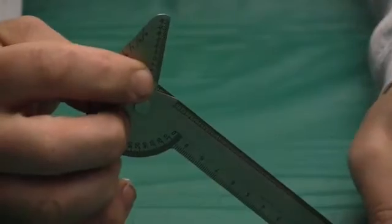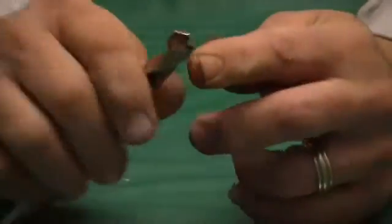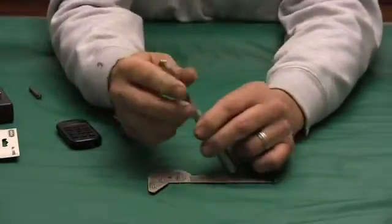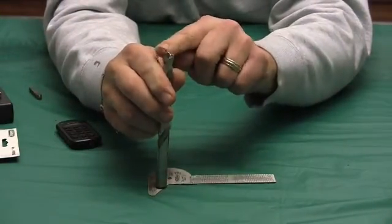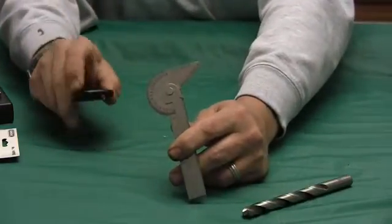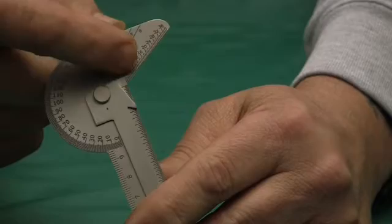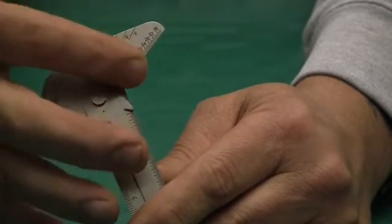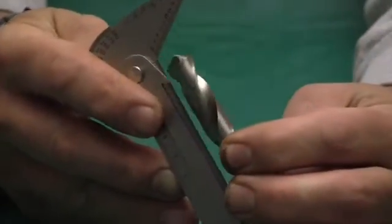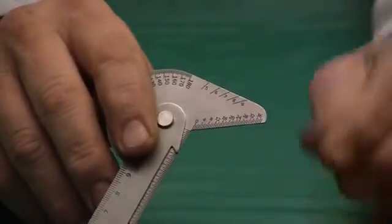And then what you use this graduation here for is to make sure that when you're grinding the drill, you want your flute lengths to be the same, to be on center. The reason I got this tool specifically is that this graduation gives you an easy visual reference of the length of your flutes when you put it up against there. And that's why I got this.